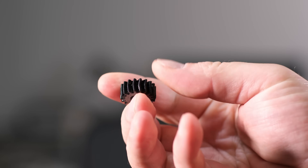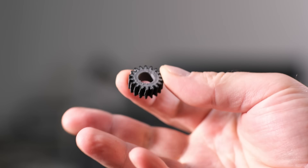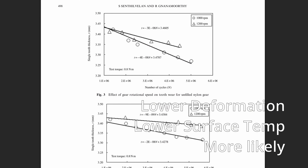So back to that point of maybe I was wrong about being so clever with gears like this. I found a few papers and it turns out that the glass fiber doesn't increase friction very much, except at the very beginning. Long-term life analysis tends to show that friction levels come down, and glass fibers in tests basically end up exactly the same — if not sometimes better — because the glass fibers are a little more slippery somehow. So there was no real mechanical benefit I thought I was getting there, but we've still solved the exterior touching problem.